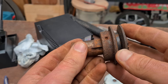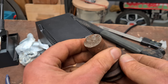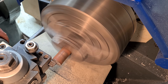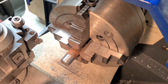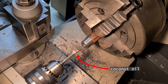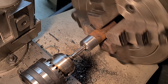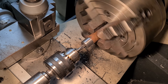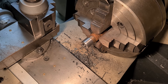Found this old cut-off shaft thing — no idea what it's from, it's just in the scraps pile, but I think we can make that work. The output shaft on the wiper motor's integrated gearbox is an M8 thread. Considering the speed and load requirements of this would-be spindle, one could almost certainly get away with making this out of wood. All we'd really need to do is add a robust 8mm joining point to the wooden part, with some kind of pronged insert nut type thing.